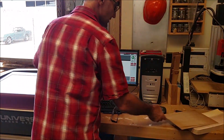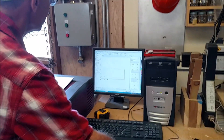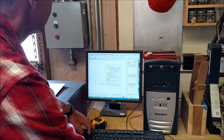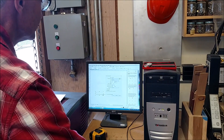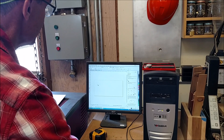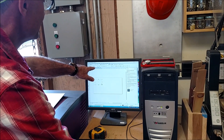On the computer, I go to Corel Draw and go File > New. I usually set this to either the size of my board or the size of the bed — I'm going to call it 24 by 12, the size of my bed on my Universal. This has to be RGB. Then I'll create a text box down here. The text box is within the window of 8.5 by 11, so my text box is 5.6 by 4.